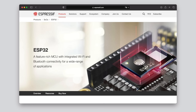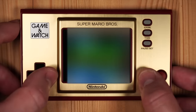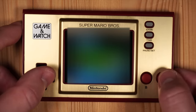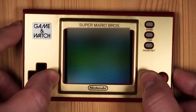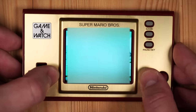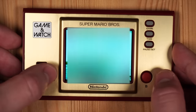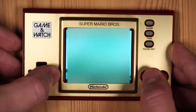Now let's talk about software, which has also seen some great progress. On the NES and Gameboy emulator side, we now have standby support, so when you press the power button, your current game state will be saved to flash and resume when you turn the device back on. As we are saving to flash, this also means that your game is saved even when your battery runs out. Konrad also implemented different screen interpolation methods so that now all games run in fullscreen, and during compilation you can set different interpolation methods.